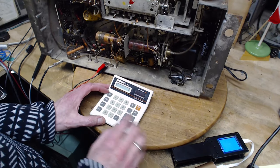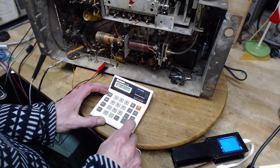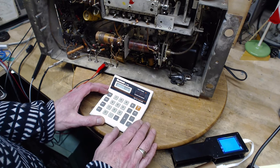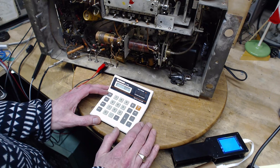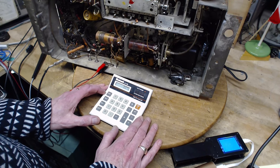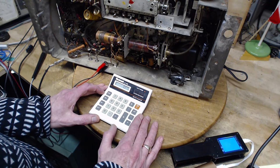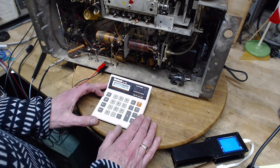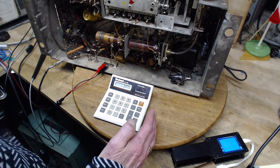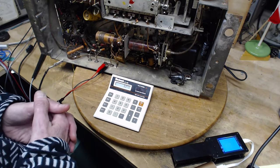125 milliamps, so that would be 0.125 times 0.125 times 600. Watts. Well, what did I just calculate? I calculated the amount of wattage expected to be sustained by the field coil. The field coil is trying to throw off 10 watts. A lot like the sun, the small heat production inside that coil is building up inside. That's why 10 watts is leading to a pretty high temperature over time.